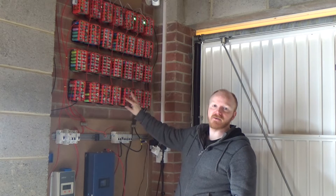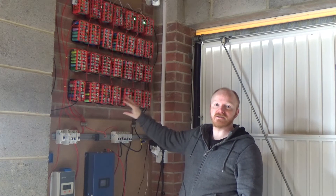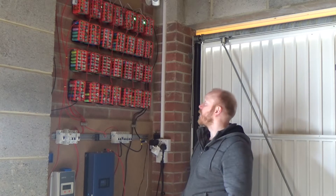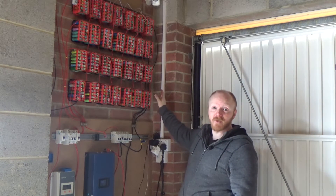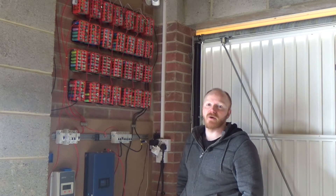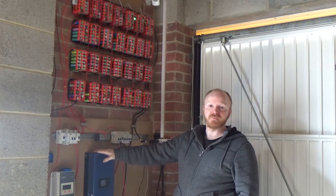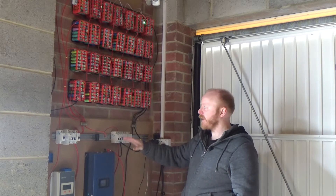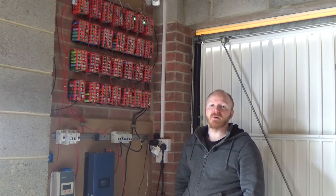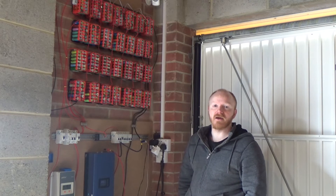This pack is sitting at about 3.8 volts and the others are sitting a lot higher in the 4-volt range. One of them has managed to bump itself up to 4.3, which was worrying as well. So what I've done is put the inverter on to pull that down. The BMS itself I had a bit of a wrestle and struggle with to get going again, but I've got that going.